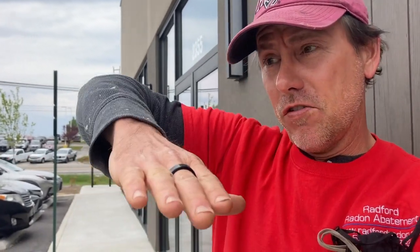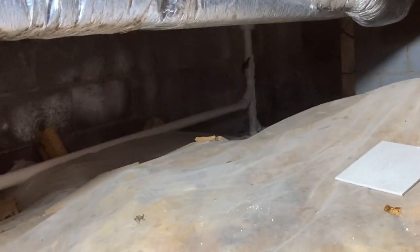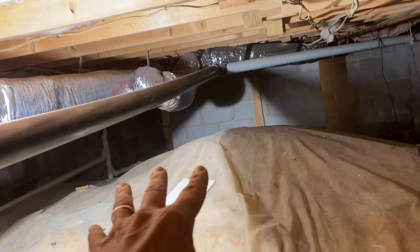I'm actually at a Starbucks editing this video, and something I didn't point out while filming: all those suction points slope down. Make sure your suction points slope down like a drain, because radon systems generate condensation — the fancy word for water — and it must drain out. If your pipes aren't sloped properly, water will stay in the system and clog it up. I thought that was worthy of mentioning. Also, I used exactly 40 feet of small pipe for all of this — just bring a lot more than you think you'll need, because it gets gobbled up quick.